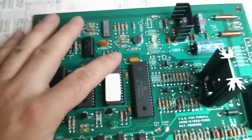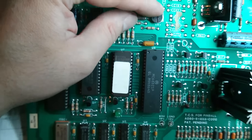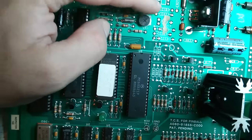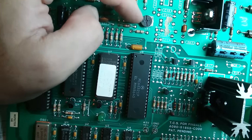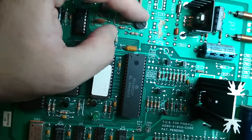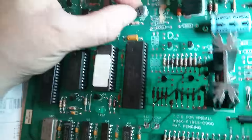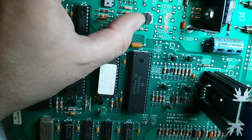So this is the soundboard on the bench. On these Bally soundboards, the volume control here — this is the master volume control — these get dead spots on them. So you adjust it to a certain position, and then after a while it goes dead and you get no sound, then you have to move it again and so on. They're not very high quality, they oxidise, and you can clean them to some extent, but they're just going to keep doing the same thing.